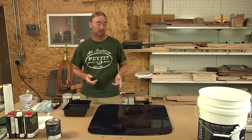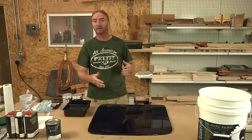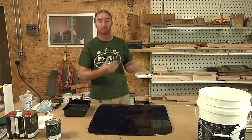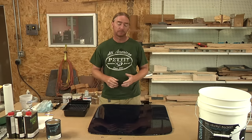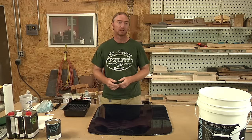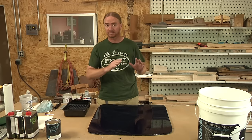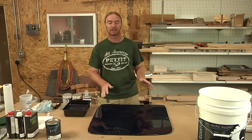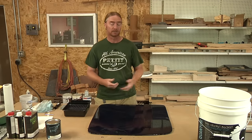Shortly after I applied the first coat on here, I got pulled away with work and I missed my re-coat window, where I could just come back and apply the second coat without having to do anything more with the surface. So with the brushing activator, which is what we used, if you wait more than 12 hours between coats then you need to scuff the surface again or sand it back down, clean it, prep it just like we did initially, and then you can continue on.